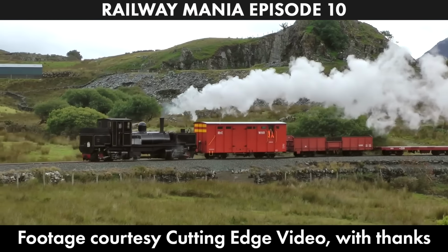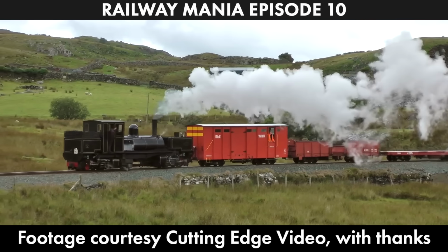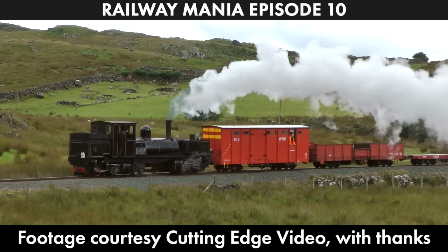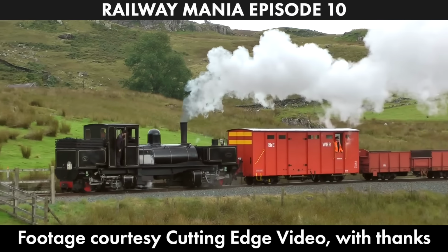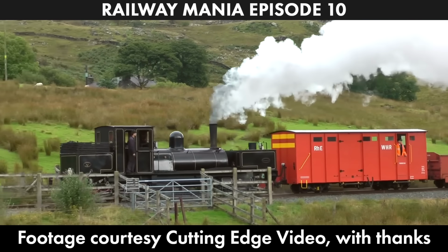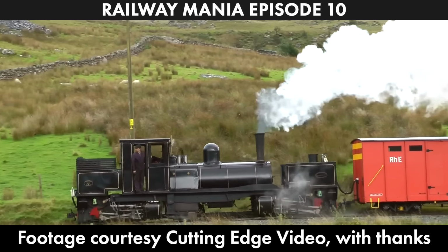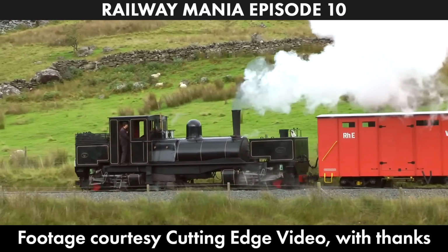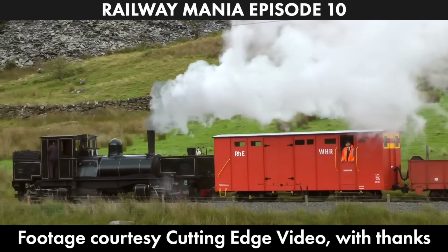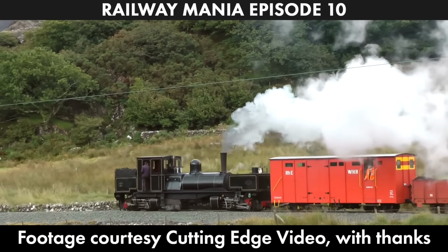You don't have to bother putting tanks on the side because they carry water and coal front and back. You can have a slightly bigger firebox, which gives you more heating area. So I'd imagine, if you try and compare the two, the Garratts will be slightly more efficient, mainly for that reason: what size boiler you can put into them, whilst being able to pull much more. So size for size, in an equivalent day, they probably use more fuel. But what you can get out of them is so much more than a conventional locomotive.